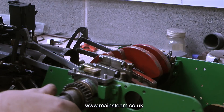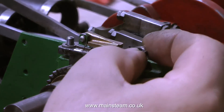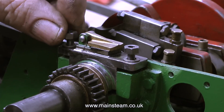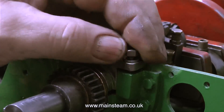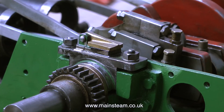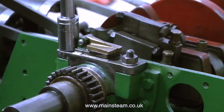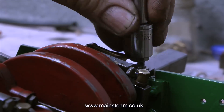What I'm currently doing is fitting the bearing top caps. Previously I've already profiled these so I know they're going to fit okay — not too tight and not too slack. To avoid damaging the paint on these very visible items, they haven't been painted. I will paint these parts green when I paint the flywheel balance weights red. The good thing about this traction engine is it is definitely not watchmaking — it's a three-inch scale model and even though the full size is not exactly massive, this three-inch scale version is quite big. These bearings are a really good fit on this crankshaft — there is no shake at all, nor is it tight. It's technically perfect and I'm quite pleased with that.